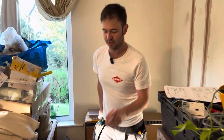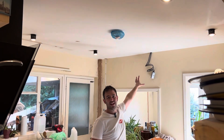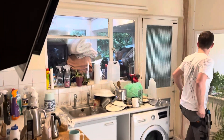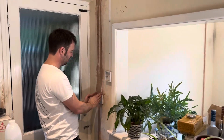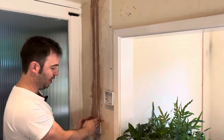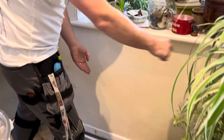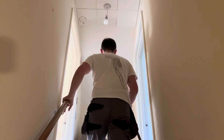A few spotlights, a heat detector, and a future extractor fan supply. There's a new cooker supply — the future oven supply is right in the zone next to the light switch, which is always the right approach — keep it in the zones. The six mil cable is on the left, chased into the floor with a loop of 6mm there for the client when they relocate the oven.